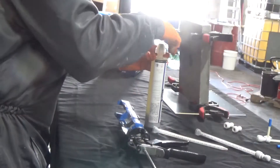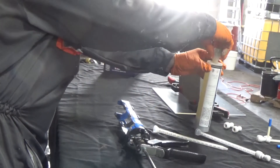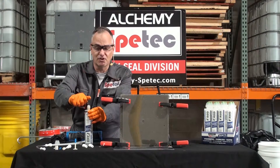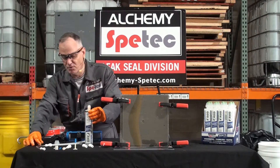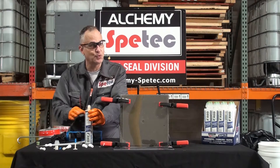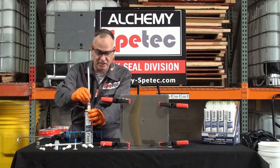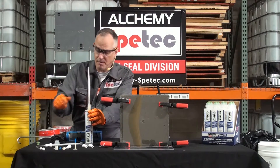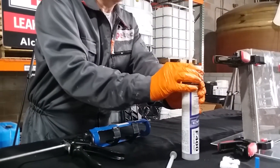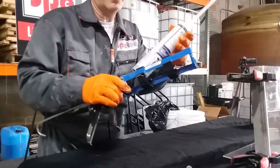Very simply, this comes like this. You'll have the static mixer. You can unscrew the cap here and remove the green piece — sometimes it's a little tricky, but this one came right out. Now, once I've taken this green piece off, you don't want to point this at the ground. Gravity does work and it will cause the product to come running out. But I can just go ahead and pop on the static mixer there, pop my nut back on, and wing that right back down there.